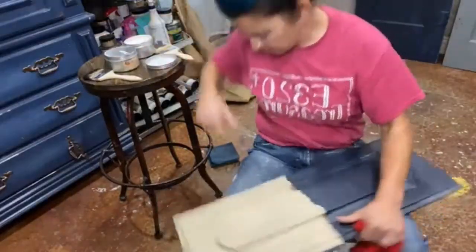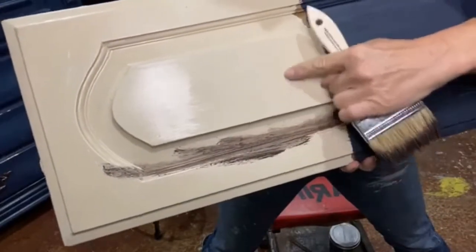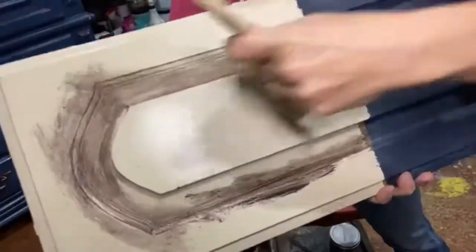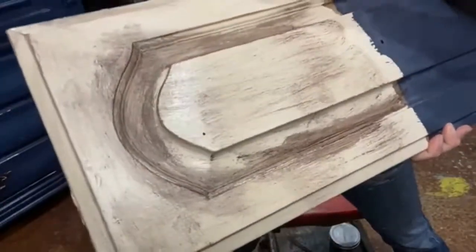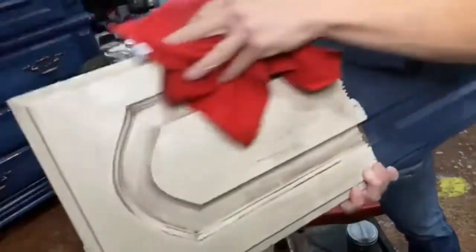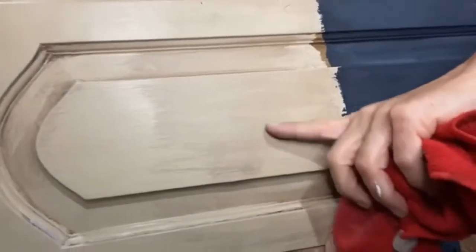We're gonna put some brown wax on the sun-kissed side. Here's our brown wax — you can see I'm a heavy user of my brown wax. Coming back again in those grooves. This is sun-kissed silk with no clear coat. Over here I went ahead and put a satin on it just to give you a look at the different finishes you can have with silk. See how it wipes almost completely off the satin, but it stays really nicely on the sun-kissed part without clear coat.